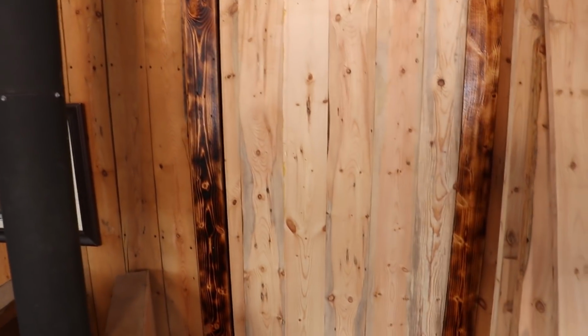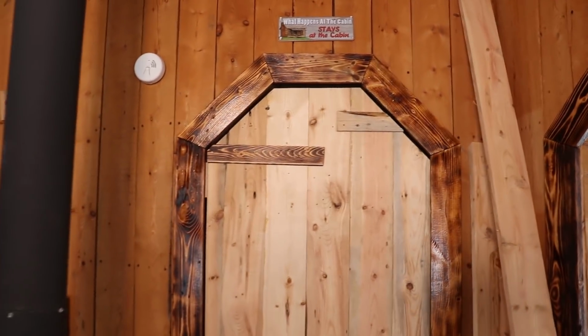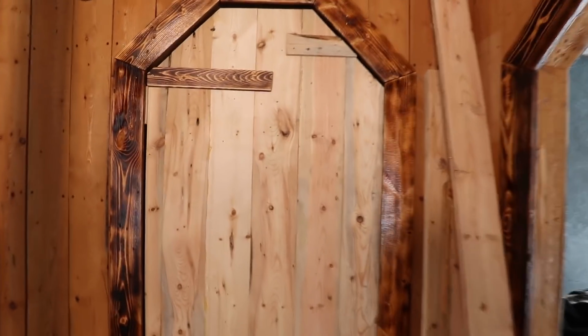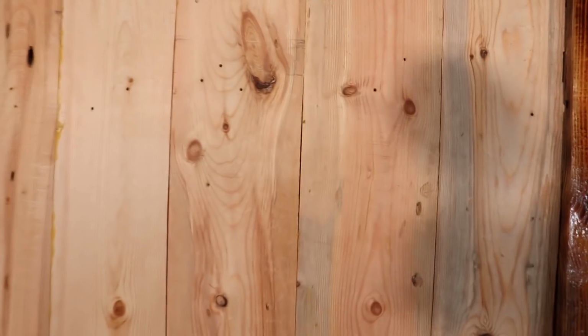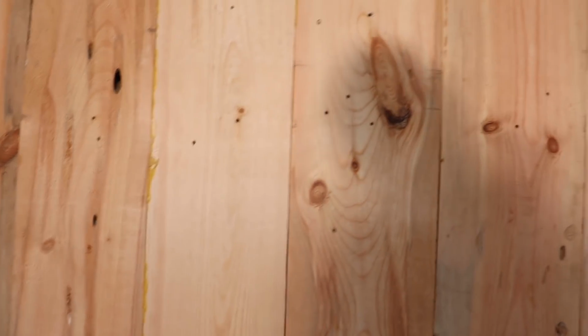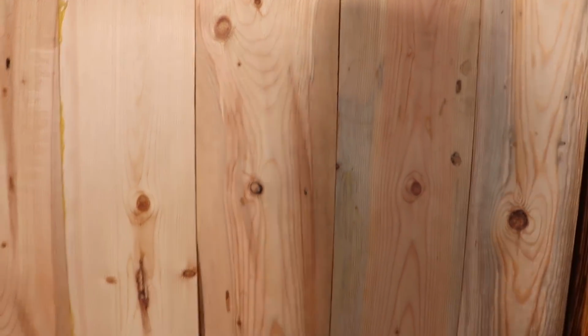And this is all of our own lumber that we harvested this winter and milled. They've been drying lots this winter, so they're very, very dry. And these are just 2-inch thick. So we're going to take those off very shortly. We're going to sand that all up nicely. There are not too many joints in between, as you can see. You certainly can't see through it, that's for sure. And as I sand it, I will mix up a little solution and put some sawdust and a little bit of glue in the cracks just to fill that up, and then we'll sand it the rest of the way, and then we'll put a clear coat on it.